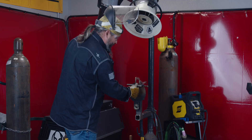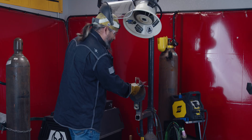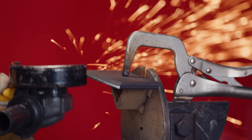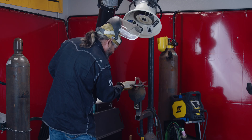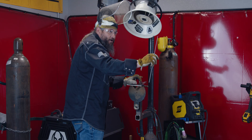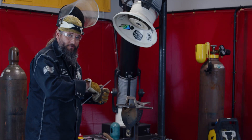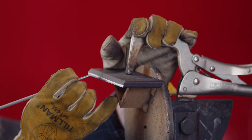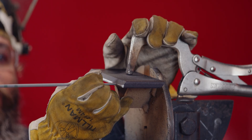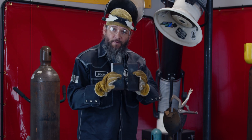Now we've started putting this land on, but take note: there's going to be a burr on the back of this. Before we measure to see if it's an eighth or not, that burr has got to come off. Gently run it off and you're looking for nice and smooth on the back side. Here at Western Welding Academy our 6010s are eighth-inch 6010s - not all 6010s are eighth inch, so make sure of what you're using. We're going to take our eighth-inch rod and measure our land.